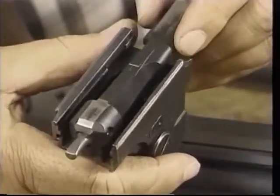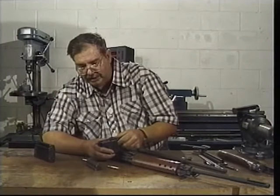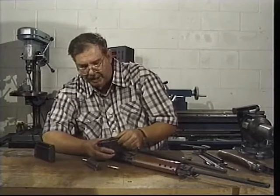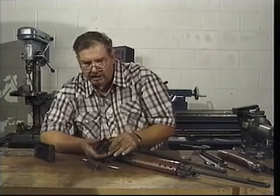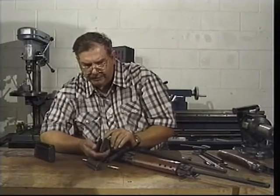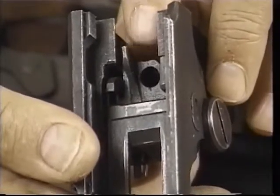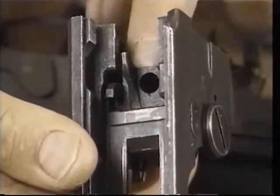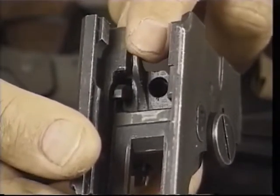The hammer is actually pushed down by the bolt carrier, so that, again, you have a very safe system of firing pin isolation from the hammer. Now you can see inside, the ejector is right here, and here's another difference. On an inch gun, the ejector is integral with the ejector block. On a metric gun, it's actually a replaceable part.